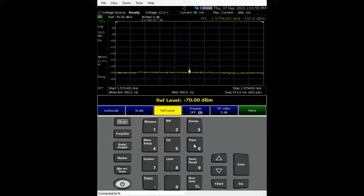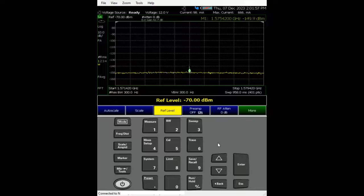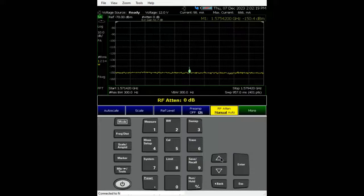Something to be aware of: when using a very high-powered amplifier with high gain, always make sure there's no strong signal within the band of interest. Even though we have a good pre-selector, always be aware of the ADC overrange message. If in doubt, always turn on the RF attenuation — yes, we sacrifice noise floor, but in some ways you are protecting your investment.